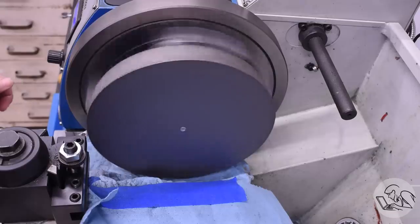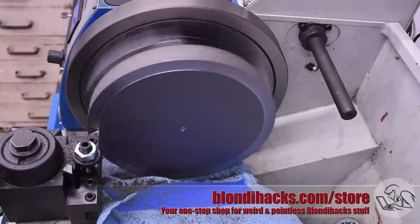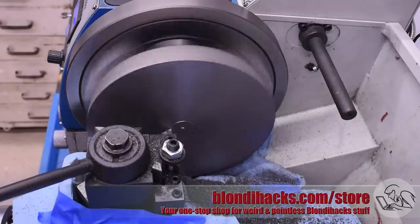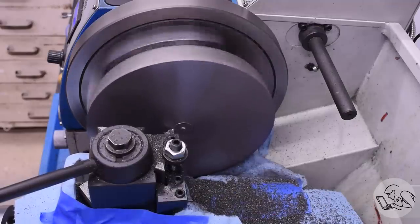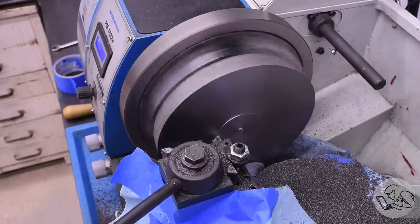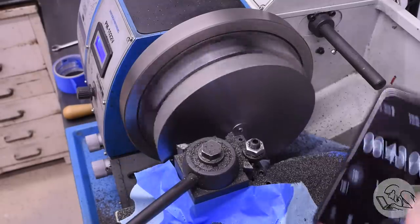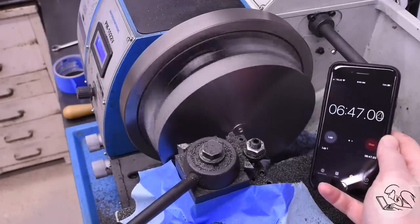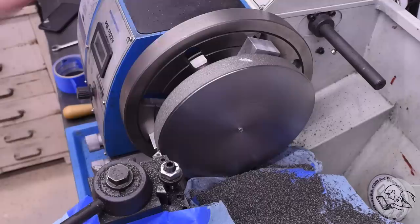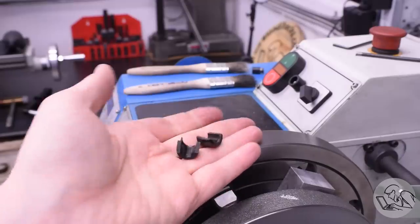I can start making cuts and face this off. I started with a fairly light cut to get the scale off without pushing the lathe too hard. I know from experience that large-diameter parts on this lathe tend to blow fuses — it has a 10-inch swing, but that doesn't mean you can turn a 10-inch diameter part; the motor torque isn't enough and the driver board will start blowing fuses. I tried to work up to heavier cuts — and boom, there goes the fuse. And it wasn't the front panel fuse; it was the back panel fuse, and boy did it blow — it took the entire fuse holder with it.